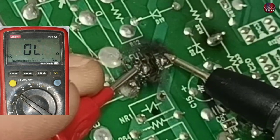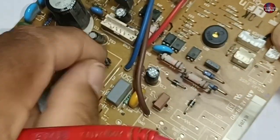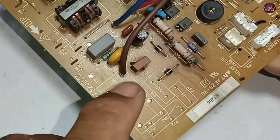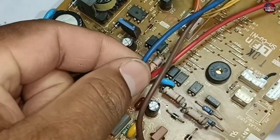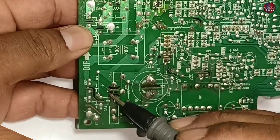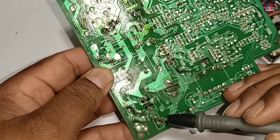The fuse is not beeping in continuity mode, but it was still making the electric breaker trip. This brown wire is the phase wire and the blue is the neutral wire. The phase wire is attached to this fuse and is disconnected from the circuit, but the neutral is directly joined in the system and is moving directly through this circuit, making the home electric breaker trip. This means this side of the circuit could be bad.